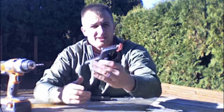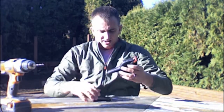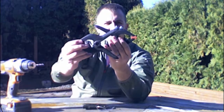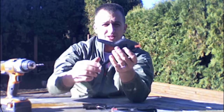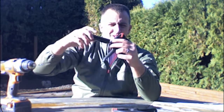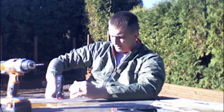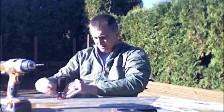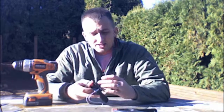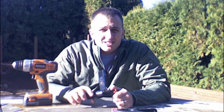Okay, so there you see the finished clip. I've got one bolt up top and one on the side, so I could set it down on its side if I want. This model is going to be more stable and hold the camera more level. You just take your camera — if you got the quarter inch by 20 bolts, your camera screws right onto that. Now if I want to film myself I can just clip it to the side, make a little adjustment, flip the camera however I want it, and there we go. That's how you make a flip cam mount for less than five bucks. My name is James Erickson — this has been day five of 30 videos in 30 days. Come back tomorrow for day six. SayHiJames.com.